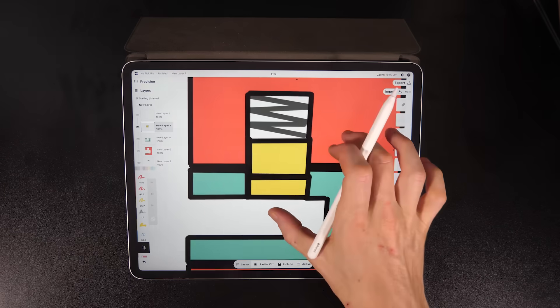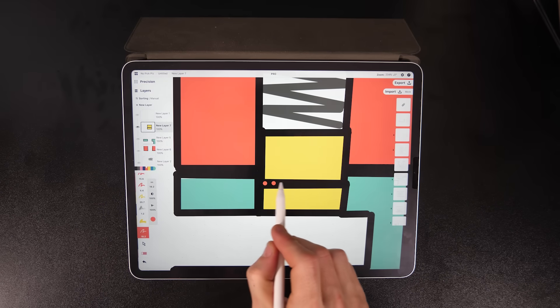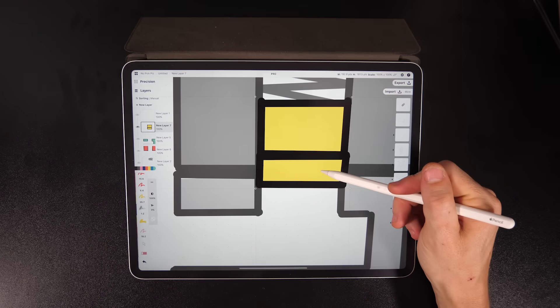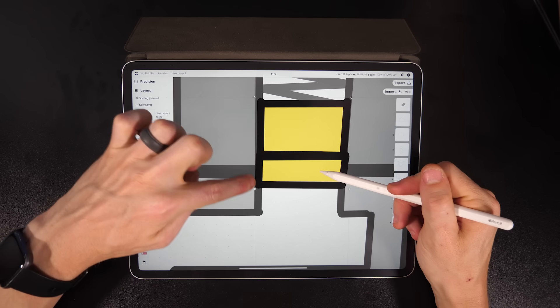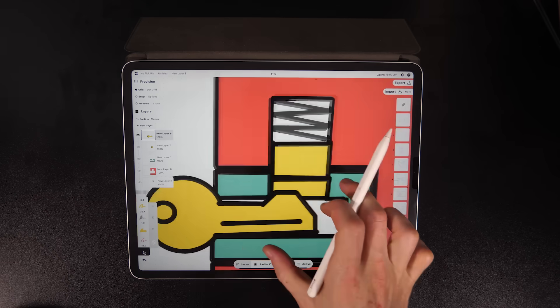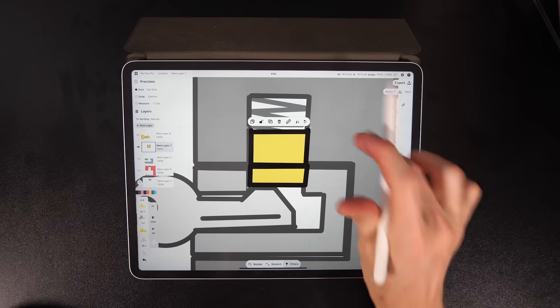If I split the pin into two pieces, I have to push on it the exact right amount so that this lines up with this. If I push it too far, the lower piece jams the lock, and if I don't push it enough, the upper piece jams the lock. A key for this lock is just something with a little wedge that will push these up the correct amount so that it can slide past.